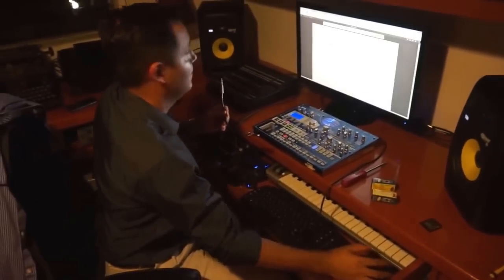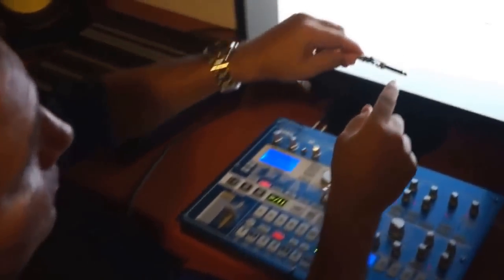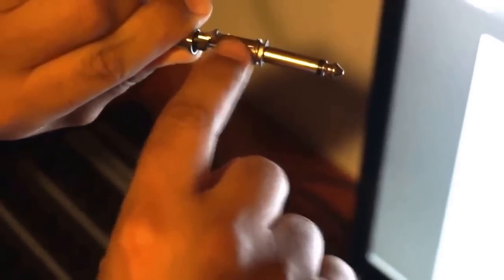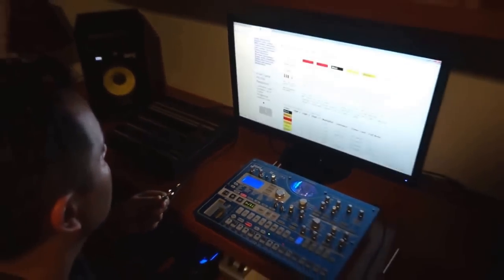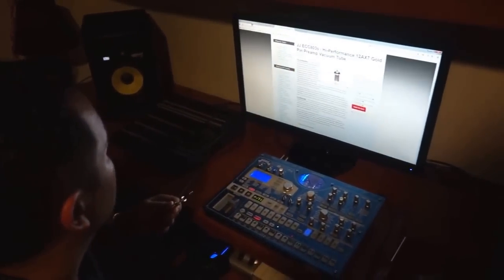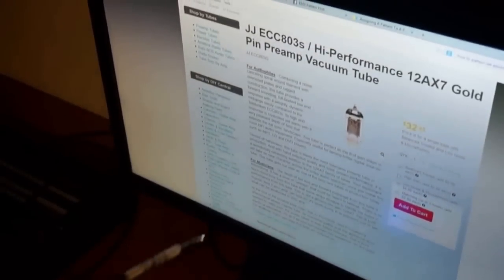Going back to the diagram: you connect these two resistors and they merge on the tip. This is a mono plug, so both of them merge — they don't touch the shield at all. You need to make sure that there is no type of contact with the shield here. You can purchase this piece on DigiKey, and I will put the part description in the description.